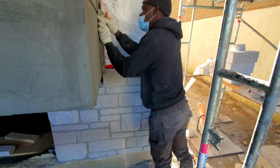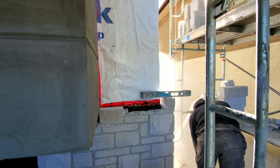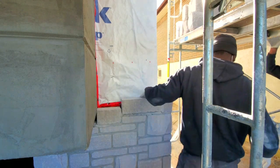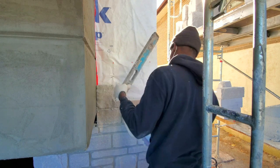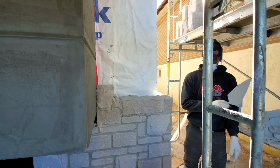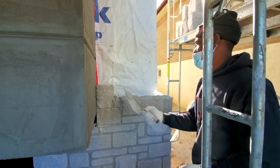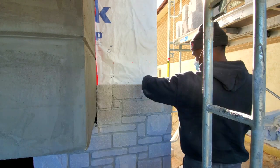Earlier I put my level right onto the wall to mark a plumb mark on the wall, so that we can follow that plumb mark all the way up to maintain straightness — from where I stand all the way to that wall by the bay window. There's the mark on the wall; we're just going to follow that as we go up, so we know that piece of wall there is nice and straight going towards the bay window.